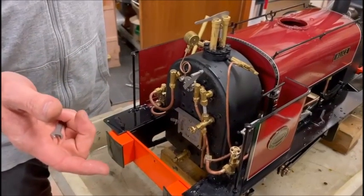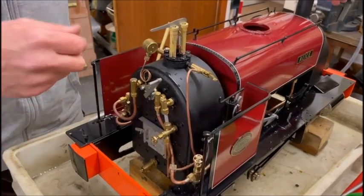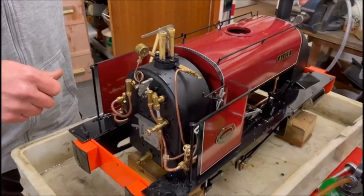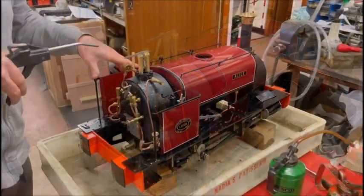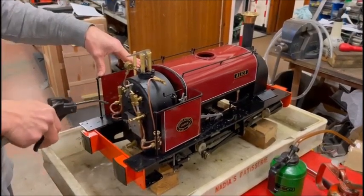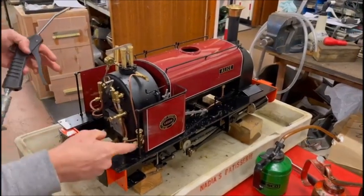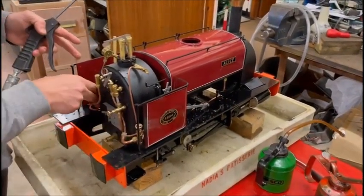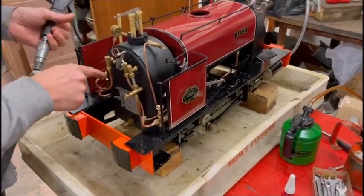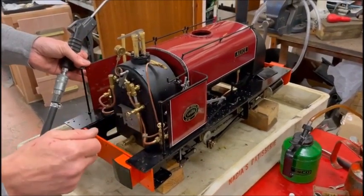That's pretty much all we do on the pumps. Once we know that they're all working, you're then on to your other mechanical parts — a good oil up, making sure that everything's ready for the new season. Just check you've got no leaks anywhere. Give it a good blast off and look around the bypass pumps and everywhere around — you just don't want to be leaking water if you can help it. If you do find you've got any leaks, undo the nut, put some PTFE on it, and reseal it again.